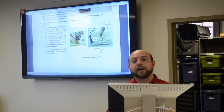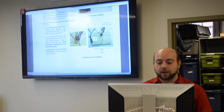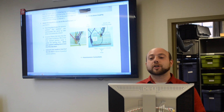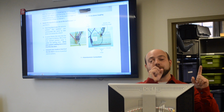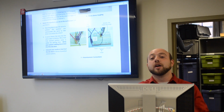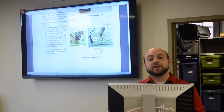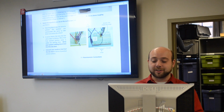For the actual wire, we always wire it so that it can plug into the shield, which will be ground, power, signal. So you need to pay attention to which wires are connected where so that you don't short out the potentiometer. If you connect the potentiometer wrong, where you connect power to one side and then ground to the center pin and adjust the potentiometer, you'll get into a scenario where you get 0 resistance and the potentiometer will burn out and smoke and let out the magic smoke, as Ken likes to describe it.